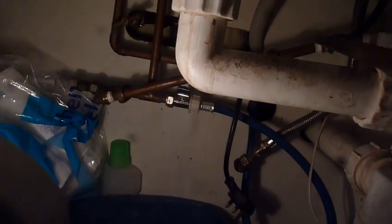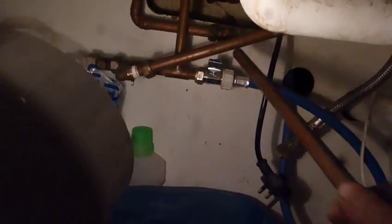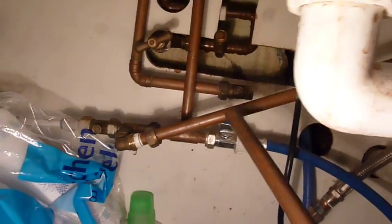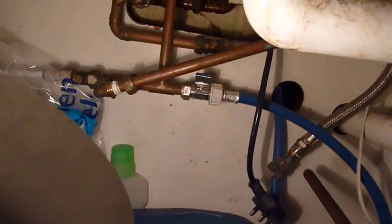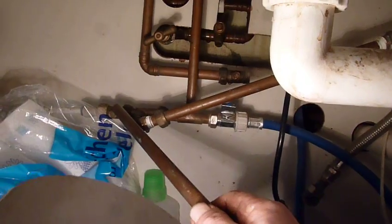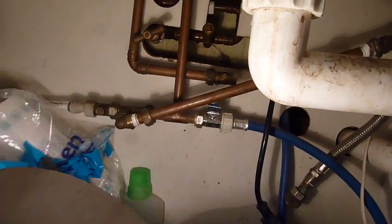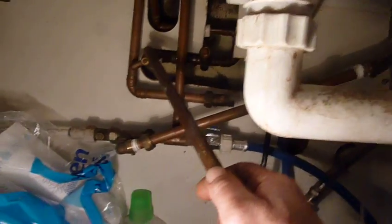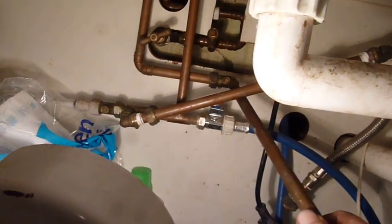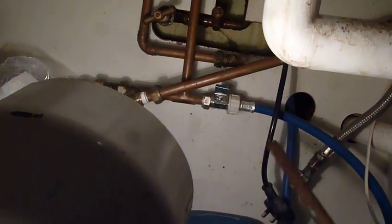The other one down here, you can see it goes into an isolating valve. I turned off the isolating valve then undid that one, so that's halfway done. The other one looks like an isolating valve but it's actually for something else, so I turned off the cold water supply there. I'm pretty sure that's the hot water supply I've turned off there, so I've got both isolated.